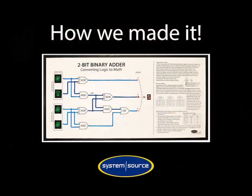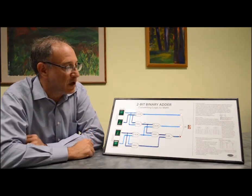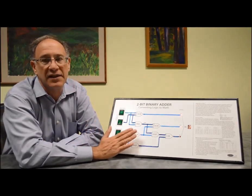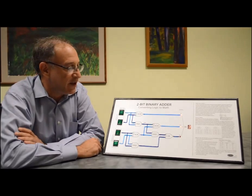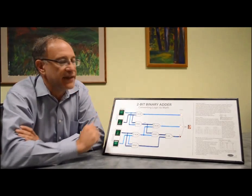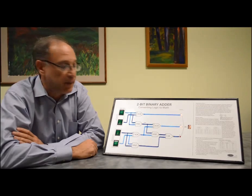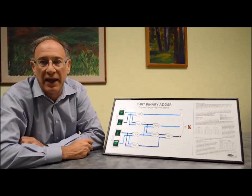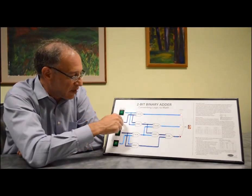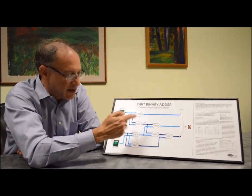How did you do this display? Aubrey and I had fun constructing it. We started with a piece of 2-colored plexiglass — black plexiglass with a white finish on it. Aubrey drew out the graphics and the text, then we used a laser cutter at the fab lab. That enabled us to take off the top layer and get the black lettering beneath it, and with higher power laser cut the holes for the switches, the LEDs, and the wires.